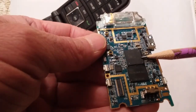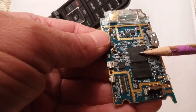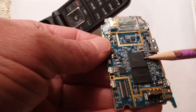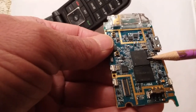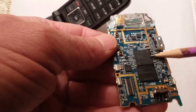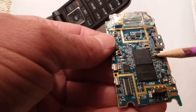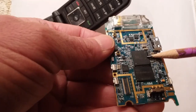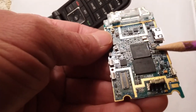The technology is a 65 nanometer. That's the width of the transistors within the chip of the lithographic semiconductor fabrication process back in 2009. Now, by comparison, the measurements of the transistors and how small the form factors have progressed through the years are on the order of 10 nanometers or even cutting edge 7 nanometers. Now, 1 nanometer is 1 billionth of 1 meter. So that's how thin and compact the circuitry is within these IC chips. Even for 2009, that's pretty amazing. 65 nanometers, now 7 nanometers. You can see how far we've come as far as speed, power, and reduction of density in the Qualcomm IC chips.